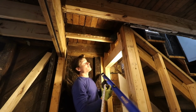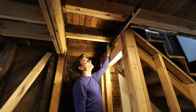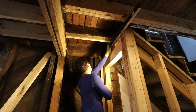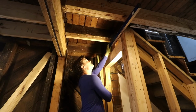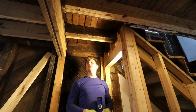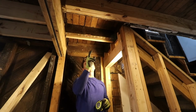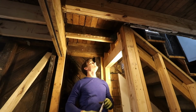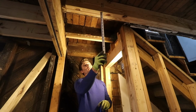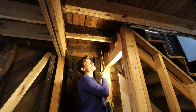A lot of doing renovations is rigging stuff up, if that's not obvious. Yeah, I got off, but I got off because I counted on the house being straight. So this was a 2x8. The rest of these doubled up joists are 2x8s. So I put this one here. Now this one's up too high, so what it would do is it would cause a kink in the drywall right here. So I'm going to split the difference.